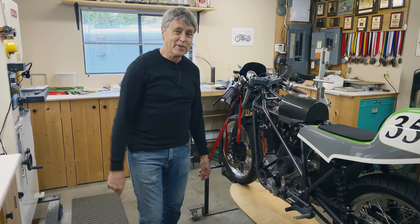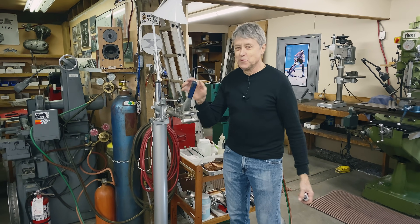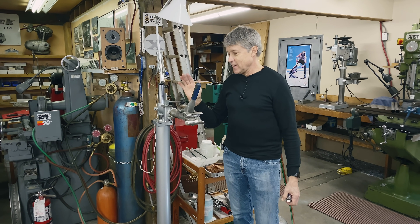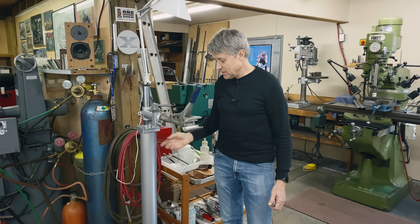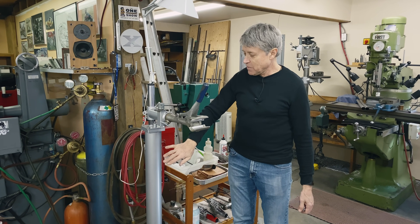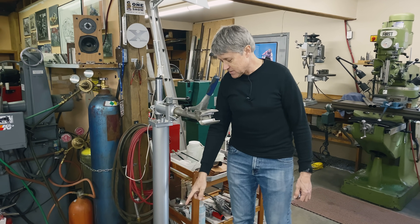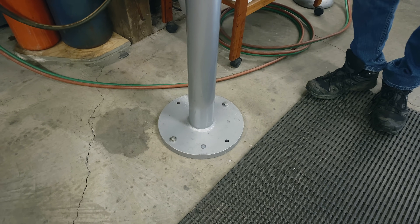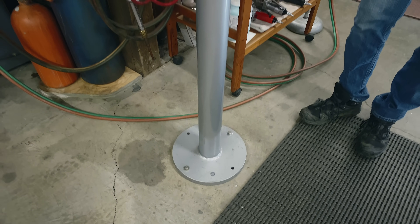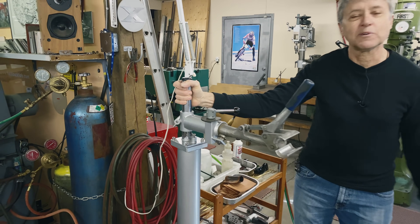Let's go to the frame shop and look around. We're at my park stand now. I've had this for years and it works really well. Someone was asking about the base. I've made it really strong — you can see how it's anchored into the concrete with a couple of lag bolts. This piece of pipe — it's not tubing, it's heavy wall pipe — is 3.5 inches. I set it at 48.5 inches up to the top, and it has no movement whatsoever.